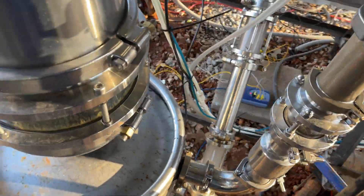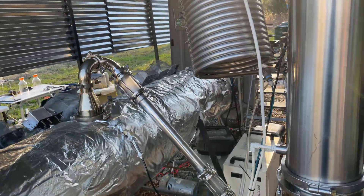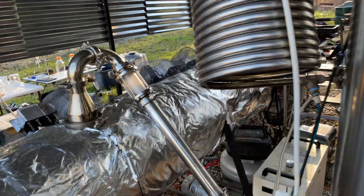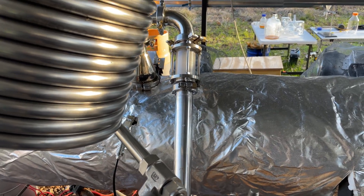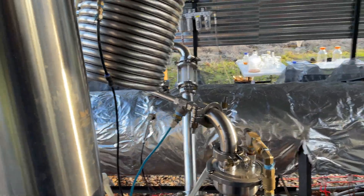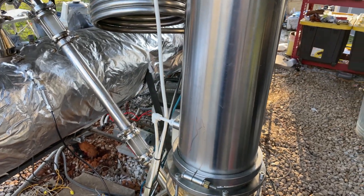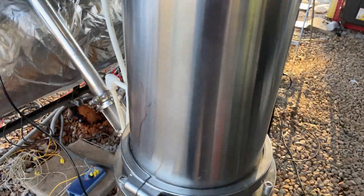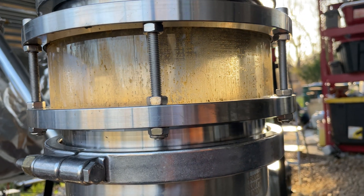Here's how this process works: when it comes to extracting liquid oils out of the plastic, it doesn't matter what liquid is coming over from the condenser — as long as there's liquid forming, whether that's water or liquid plastic oil, it's going to condensate. Since we see water, we know it's only a matter of time before the machine heats up enough and we see plastic crude oil come over. About 27 minutes in, you can see the pressure drop even more, because negative pressure drops as vapors fill up the space. More molecules occupying a volume is the opposite of negative pressure. You can actually see some movement and vapors moving throughout the sight glass.